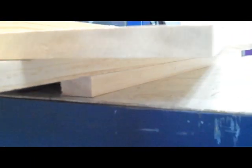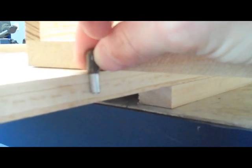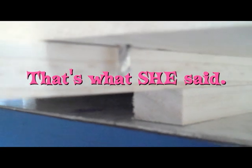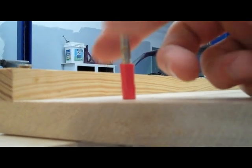This bit — I took some electrical tape and marked it. I took my peg and said, okay, my peg wants to sit about right here. This is the peg that holds the adjustable shelf — it's going to be four per shelf. I put the drill bit in my jig down to the desired depth — that's as far into the board as I want to go. So I took that tape and put it there, so now when I drill down, I stop at that tape mark.